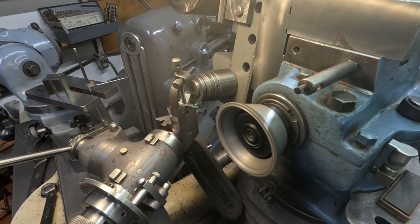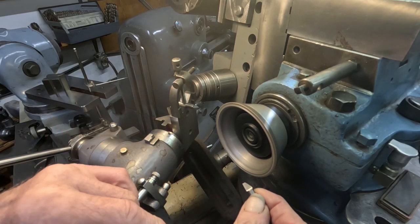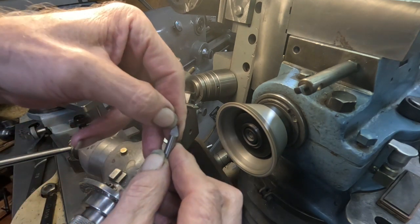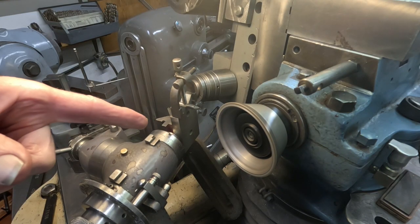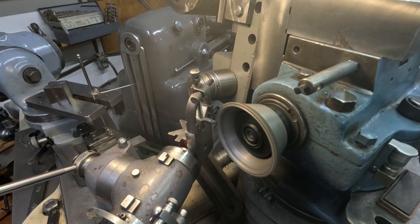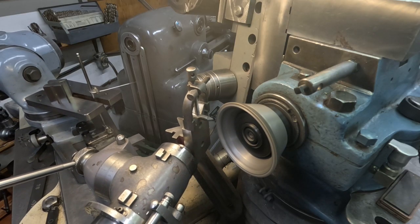Fooling around with these things, I found it was better to bring them to this point on this side of the wheel, and do the left-hand edge of it — the left side that cuts the thread against the right-hand tool — this edge from this side. This is a real easy setup for a quick re-sharp. Get even just a little tiny bit and polish it. I'm kind of anxious to see how this will cut.